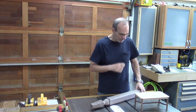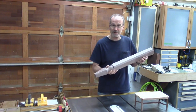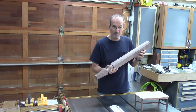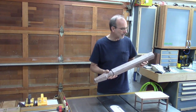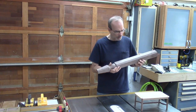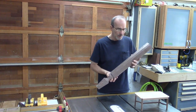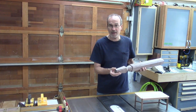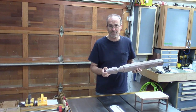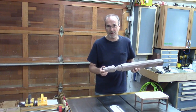There's some interesting joinery I've got to accomplish on this. This is one of the legs — obviously there's going to be four of them. Four legs. And these are three inch solid walnut. It's octagonal in design. There's a turning on the bottom, and there's actually an eight-way taper here on the bottom. These are a lot of fun to build, and I'm going to show you how to do that right now.